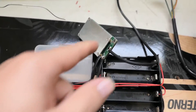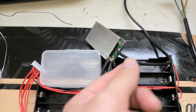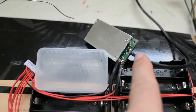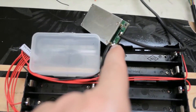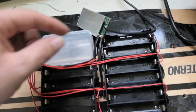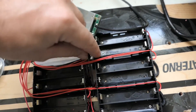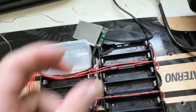Alright so I unplugged the BMS and then what I did was I soldered a cable out here from the P negative which is what's going to go to the controller. The negative of the battery goes here which is coming from the negative of this pack. Also this wire here is going to go to the negative on this side. So right now I actually have negative power here.